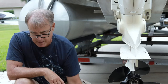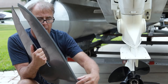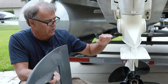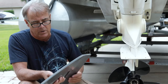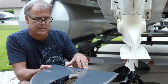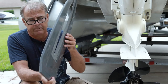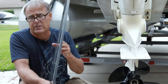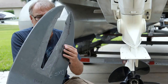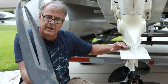The PCP is basically recessed. It can be a flat plate in some cases; as we're selling it, it can also be an offset plate. This is about the fifth or sixth prototype for the Avalon we discussed earlier. It can be actuated — there will be actuated mechanisms to change the angles the PCP offers. In this case we're going with a fixed downward profile with a very high lift ratio. Looking at the size of this plate versus the original anti-cavitation plate, this PCP is somewhere between three to four times the size.